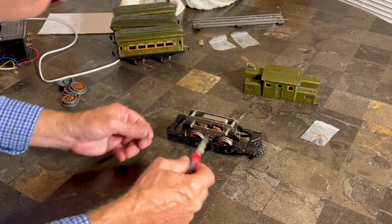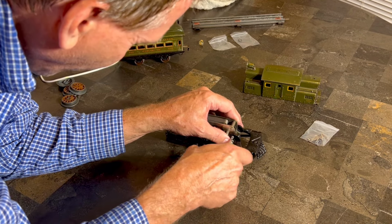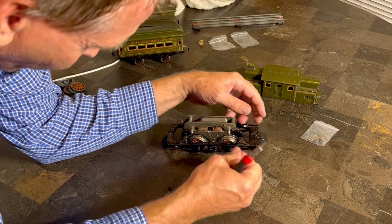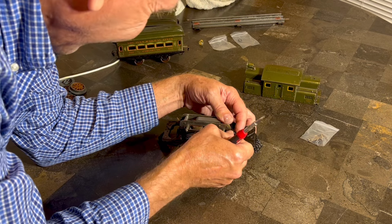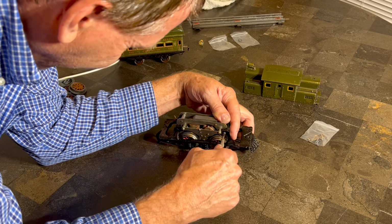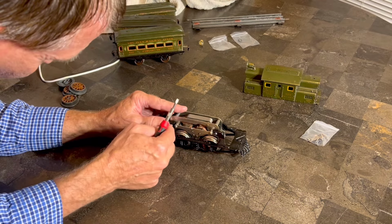That was pretty quick. This cast iron cleaned up pretty nice. I didn't repaint it or anything. It looks really nice. Actually, the chassis turned out pretty nice as well. When you're cleaning up these old chassis, if you're inclined to do that, I will warn you to be very, very careful about what you use and where you use it. The armatures on these guys use some sort of adhesive that holds the collector plates on, and if you use the wrong thing, it'll delaminate them. It's almost like a glue, and it's obviously very old glue at this point, so you want to be real careful. As a matter of fact, other than your fiberglass pencil, you probably don't want to get much in there at all. All right, here we go. So far so good.